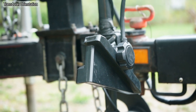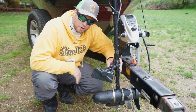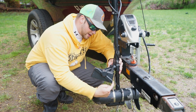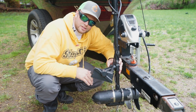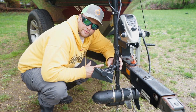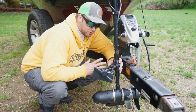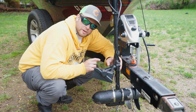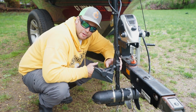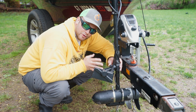Once you have your orientation figured out, you're ready to go fishing. I've used all three modes — front-facing, down-facing, and perspective mode. They're all pretty cool, but front-facing is really the best and most useful. Even in front-facing mode, the back of the transducer still gives you the down-scan view underneath the boat. If you're fishing 40 or 50 feet of water and anchored, down-scan might be what you want. Perspective mode is cool for seeing structure, but fish are a little harder to detect. I plan to use it during spawning to see bed depressions in the sediment.